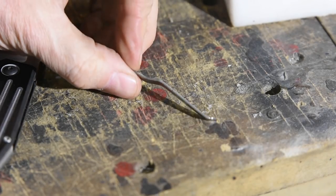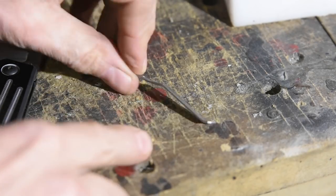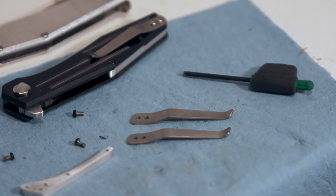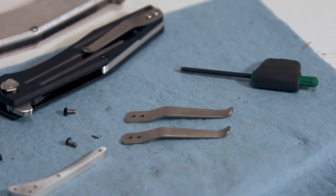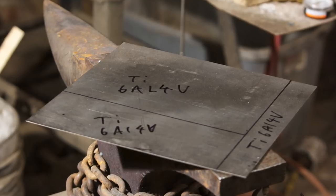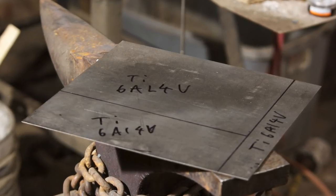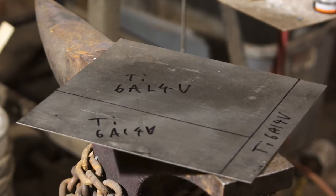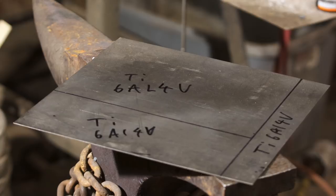That's actually a lot of stuff to do for this tiny little piece. And the solution is to have this kind of swoopy shape — you've got a flat part at the back, a little clearance section, and then a little swoopy thing at the front that will skate over the cloth and allow it to enter your pocket easily. In the knife I'm designing, my clips will start as a big flat sheet of 6AL4V titanium. Later I might try stainless steels and some other things, but right now we're working with titanium.